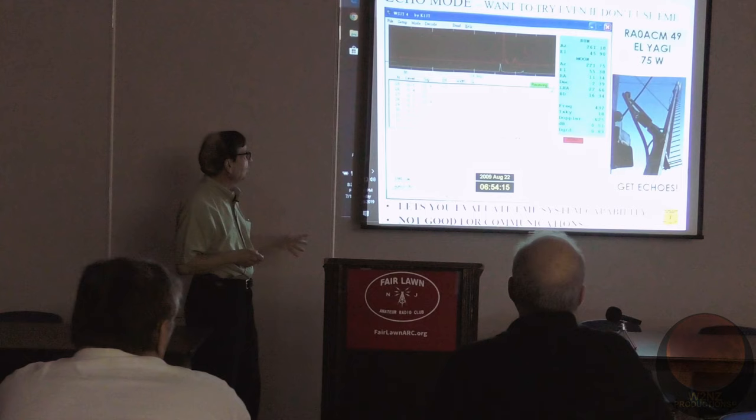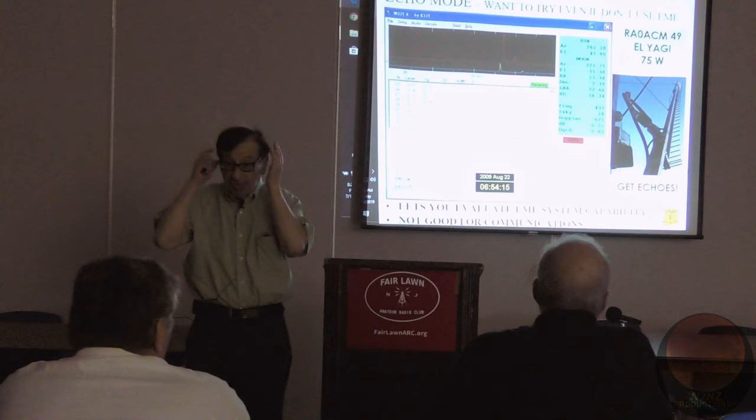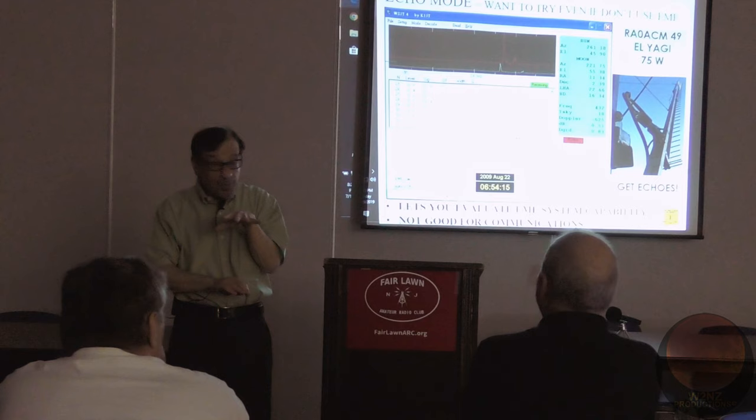One of the nice things in the JT modes is this thing called an echo mode. So you want to test your system, and if you've got a small signal with low power, you're not going to hear your echoes. I have a big dish, I run a lot of power, and even if I say hello on the microphone, I hear that hello coming back. But if you've got a low power station, small antenna, chances are you are not going to hear your echo.